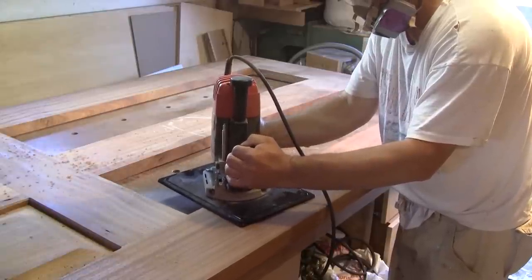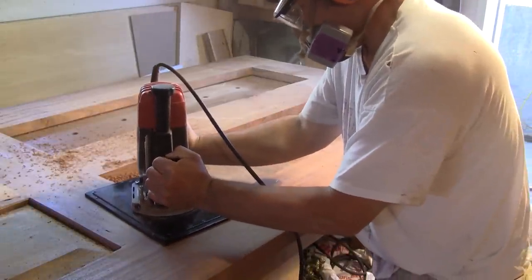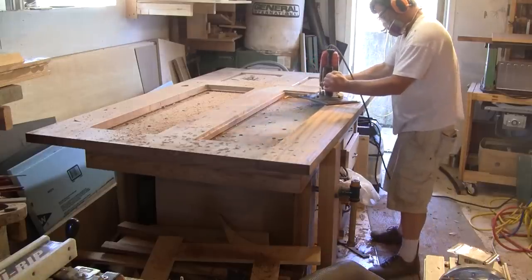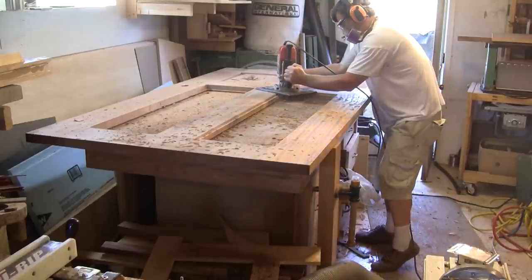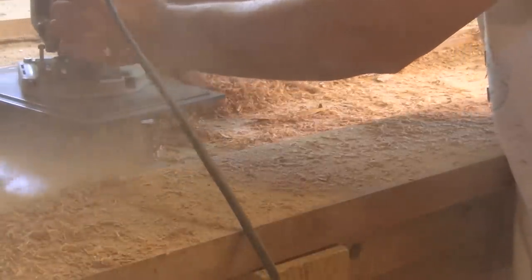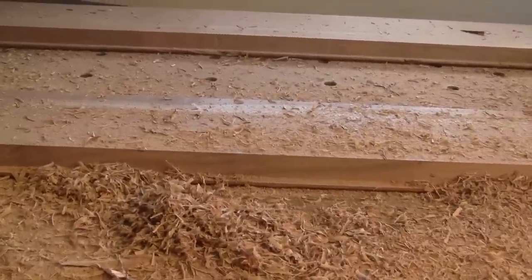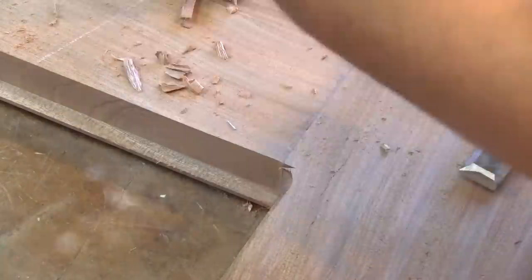Now I can make a half-inch rabbet for the glass. The router bit only cuts half an inch deep, but I need an inch and a quarter, so I use a copying bit. The first cut is done by back routing a shallow rabbet around the window opening. This creates a small rabbet so the wood fibers are less likely to break during the final pass. As you can see, this is a nice rabbet, unlike the first one I did without back routing. The glass openings need to have their round corners removed.